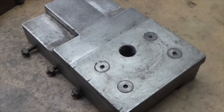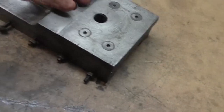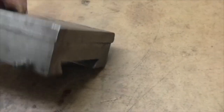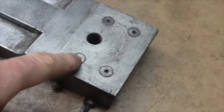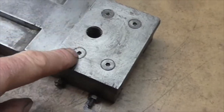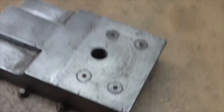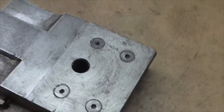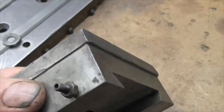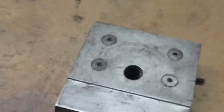In order to get the allen screws out I'm going to have to put that in an oven and bake it. Then I would machine that piece off to square it up, because it doesn't fit flush. One allen screw head already won't take an allen key, and I can't machine it in position or I'll lose even more screw heads. So there's a dilemma - I would like to make that fit properly but I can't machine it in position.